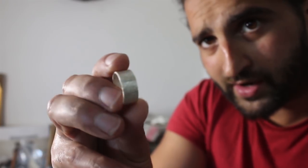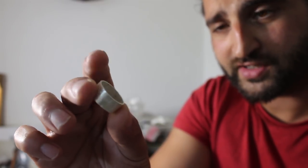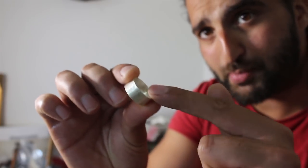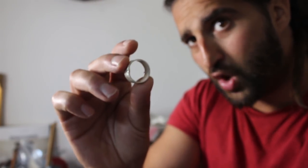There is the ring after soldering — I've just put it in a pickle for about half an hour to get some of the fire scale off. The next thing to do is to size this ring up and also to polish the insides and get it all nicely shaped ready for the wood. Let's go!